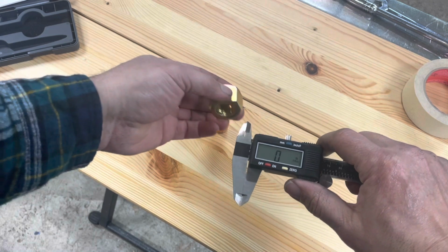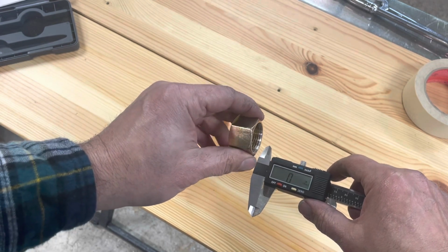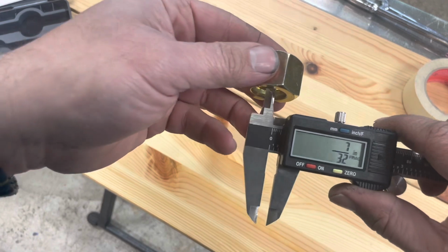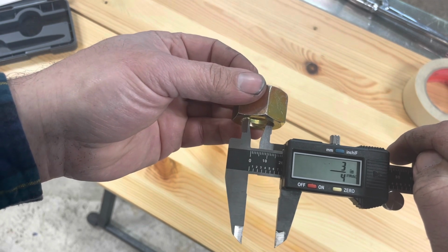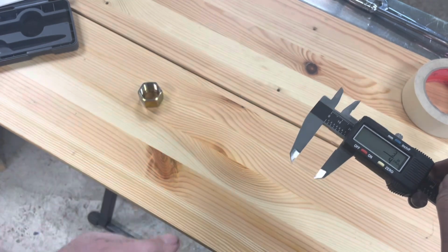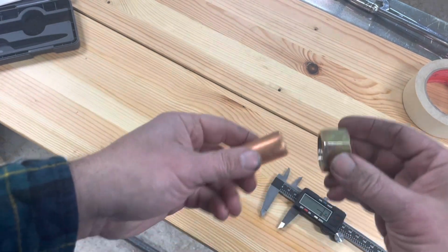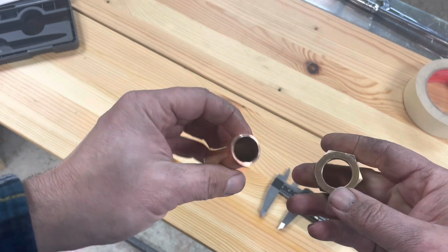So an important lesson I learned working on this project is the air outlet. A lot of people talk about it, and it's odd thread. Looks like pipe, no taper. I looked at it and I saw that it looked like just a regular old flare fitting. So I went to work and I took a measurement of that fitting. 3/4 of an inch. A co-worker was putting a new water service in the house and had some excess 3/4 soft copper. And I thought, hey, he cut me a deal on that. 7/8 OD. Soft copper, standard plumbing stuff, is 7/8. So obviously I was not going to be just flaring that. So that's why we got what we got on there now.